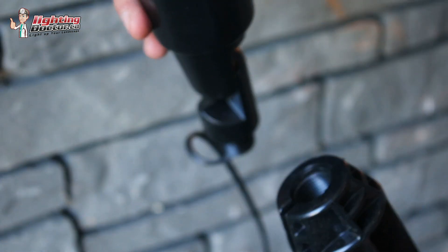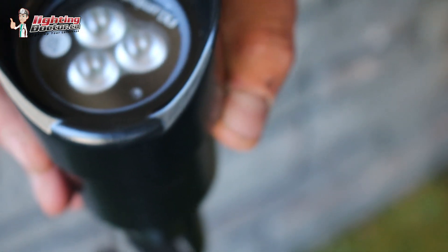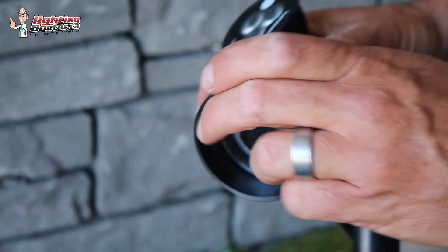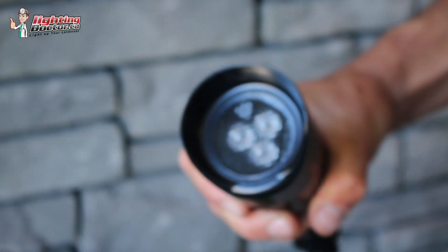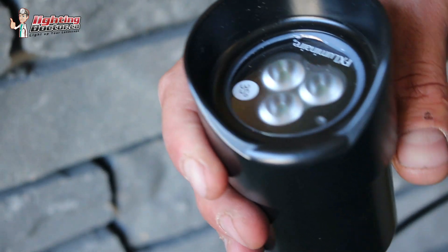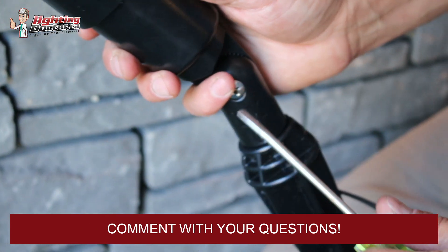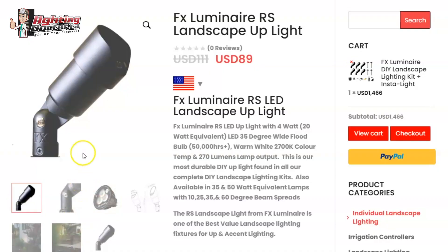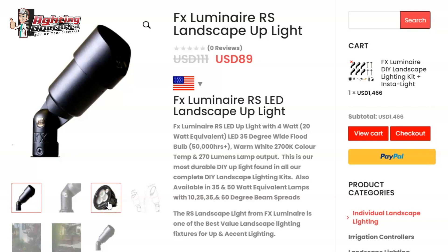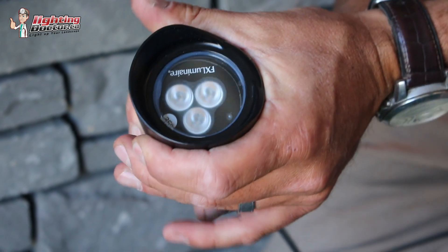I would stick with the RS. The reason I like the RS over the NP or the MP is that the MP is a great light but it's an integrated fixture, whereas the RS comes with a replaceable bulb. The RS already comes with the four watt 35 degree lamp in it, which is perfect for this application. The MP has an actual chipboard inside, so you have to order the right angle and if it doesn't look right, you've got to replace the whole fixture — you can't just swap out a bulb. That's why we love the RS, and for the extra amount you pay, it's bang for your buck.